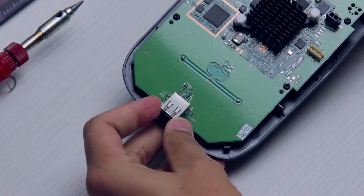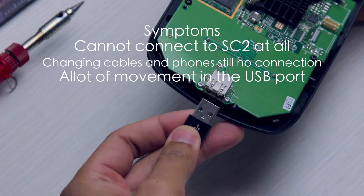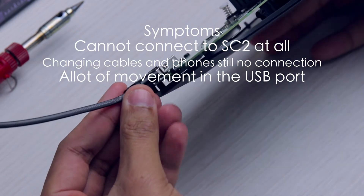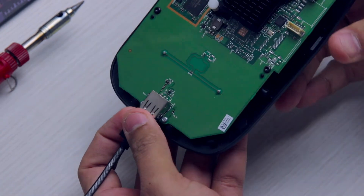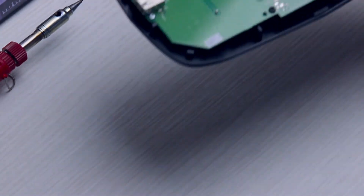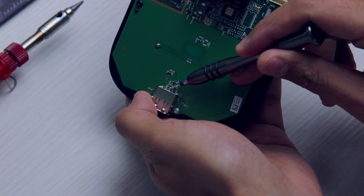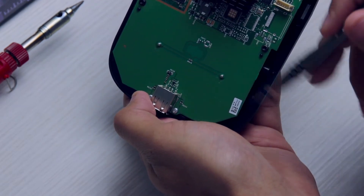So what happens when we use the USB a lot — and I can understand if we have accidents where we pull on the cable too hard, or we drop our phone, or it falls off and tugs on the cable. That constant back-and-forth movement desolders or creates a dry joint where the solder detaches from the contact pins. These are the four pins, and either one of them can become separated from the board, which is what causes your connectivity problems.